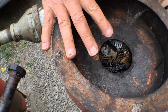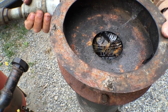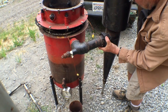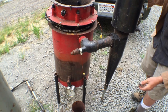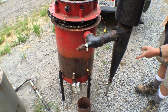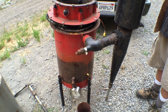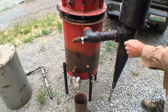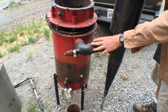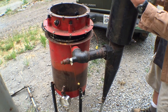This is where another fan used to be to blow it out, but it was never quite strong enough and kept breaking, so I used another source — a vacuum cleaner blower. If you have the glass jar on the bottom, it has to be sealed up. When you get your glass jar, you have to seal it to the bottom because you don't want any air going out — we're actually sucking in there because it's being pulled out this way. You don't want any air getting into the gas mixture from here out because it won't explode or flame as long as it has no oxygen. But if you start getting air leaks in here, you can have a backdraft.